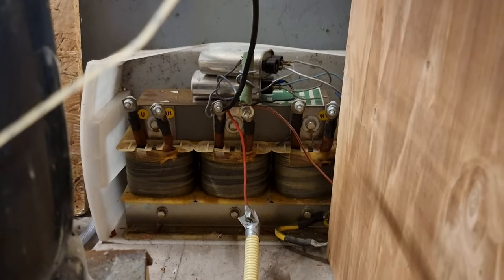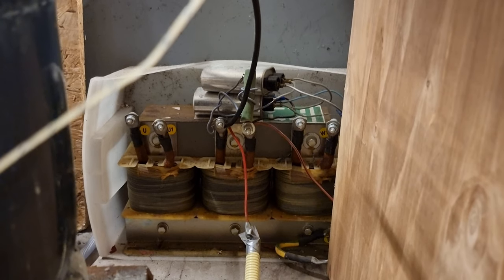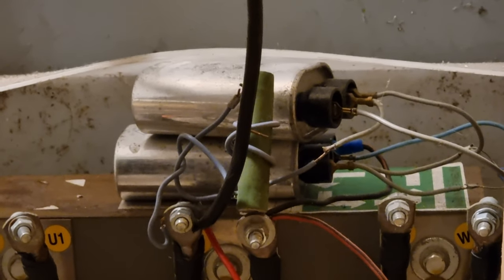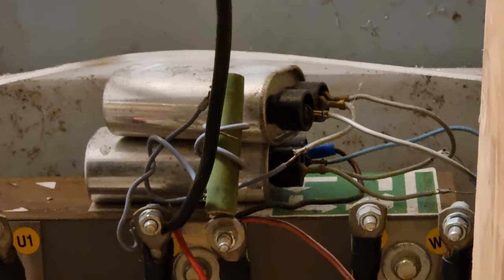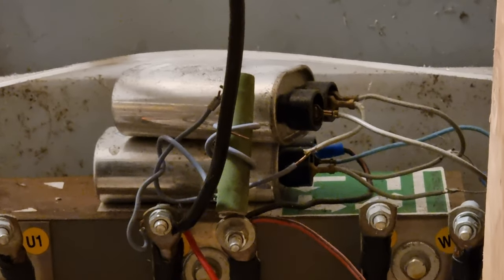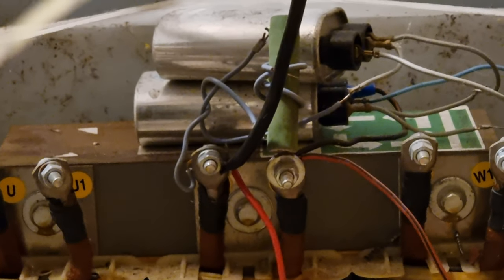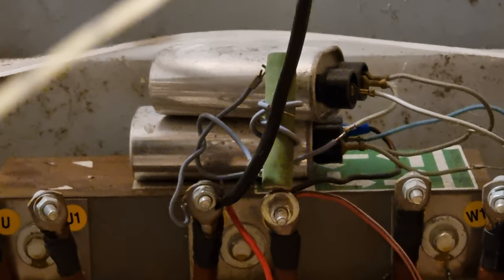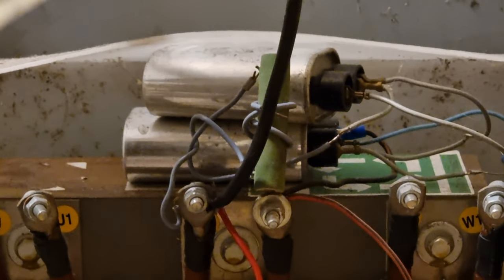But then I had to protect also the windings of this transformer, because it just flashes over. And that's this small green resistor over the winding with a small capacitor from the microwave. So when there is a really high voltage spark, it goes through the capacitor and the resistance and becomes heat, and it doesn't become a nasty spark that destroys the insulation of the transformer, or in this case the coil. Thank you very much. Is that the major component of the power supply?